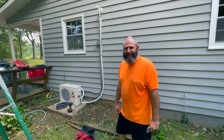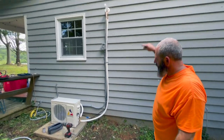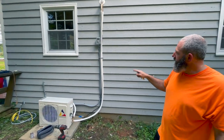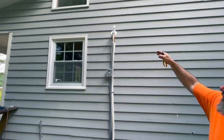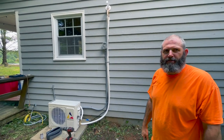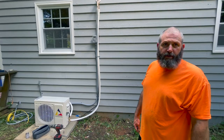We've just been working away, had a few interruptions but not too bad. We've got that electric run all the way in here. Got the cable ran, everything looking good. We're going to check that up there for leaks once we charge the system — it's still just sitting there on vacuum, everything got vacuumed down. So we're going to go inside, make that connection, and then charge this sucker up.